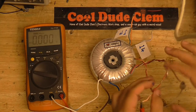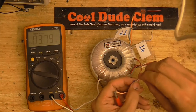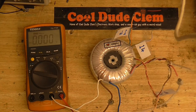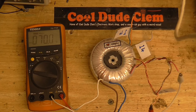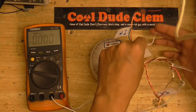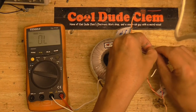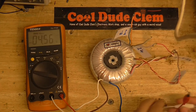Let's reverse those wires — I'll just take that one off and connect it to that one instead. Let's see what voltage we get now. Should be much bigger. Yep, we've got 70 volts now. That's more like it. Now I'm going to connect it to one of these. I'm trying to do this nice and quickly. Is the voltage going to be bigger or smaller? It's smaller. The valve has just committed suicide. Looks alright though — I don't see any signs of breakage. Let's see what we get now. If we get more than 70 volts... No, it's gone down, so it's out of phase. I'll just swap these wires around.